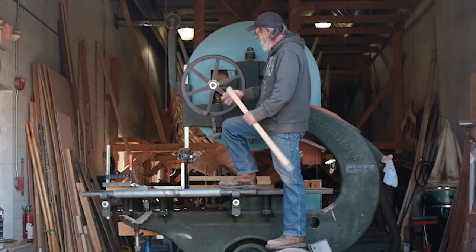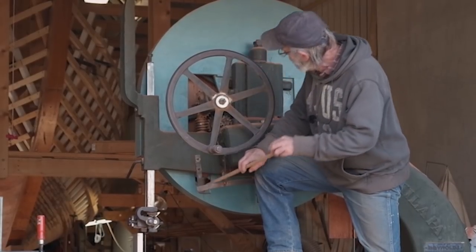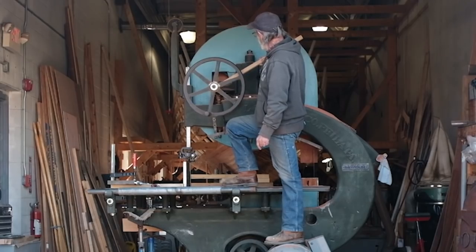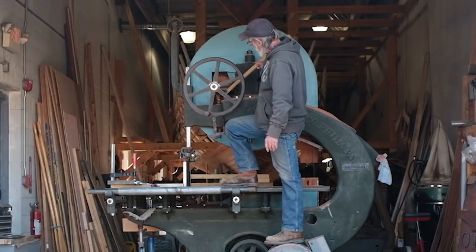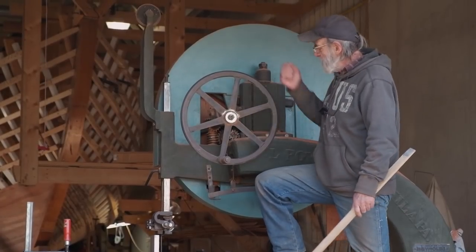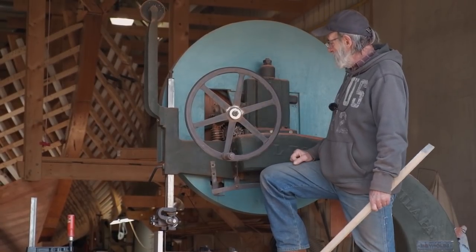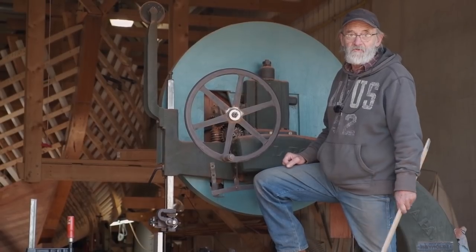We're only resawing today so I'm not going to tilt it. A lot of this stuff I rebuilt — I had to make this vertical shaft that comes up through that worm gear right there, and that worm gear meshes with another gear. Basically both of those gears were broken, the shaft was bent and broken. I made new shafts, repaired the wheel, and I changed the worm gear to a slower worm, so it takes a little bit more cranking to get the same angle — maybe seven or eight revolutions instead of four or five. But it's just easier to crank and it worked out well. The saw is not brand new, that's for sure, but it would cost quite a bit of money to replace this piece of equipment or come up with something that would do the same job.